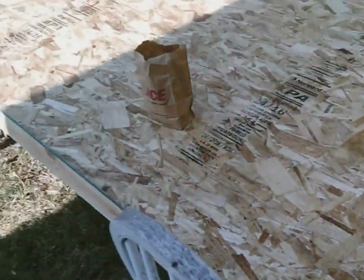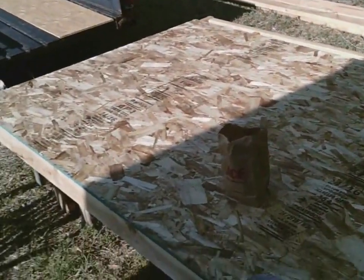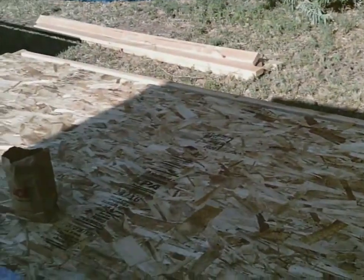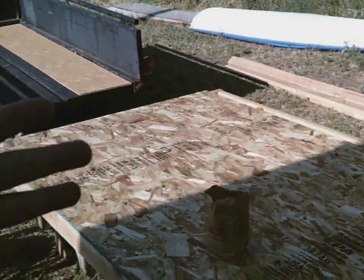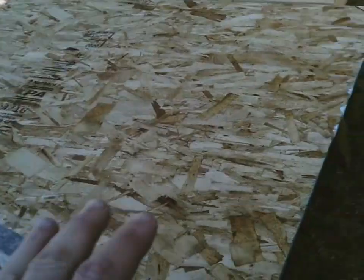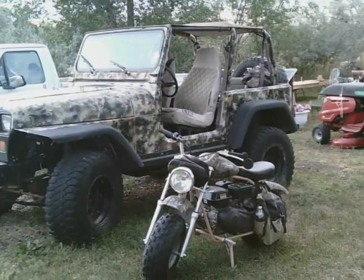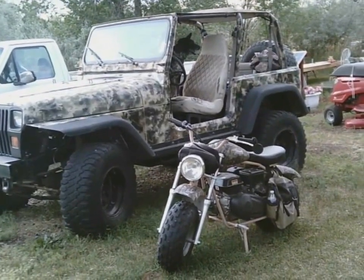The floor sheathing project for today is cutting the edge, finishing the floor sheathing with screws every 16 inches, then moving on to the end wall and sidewalls. The first end wall will be done in halves — doing half the end wall, then the sidewalls, explained further as it makes the framing easier to assemble.